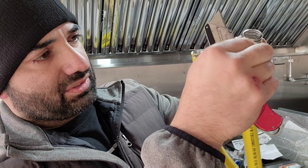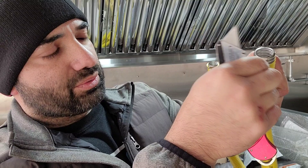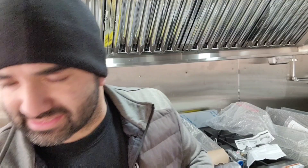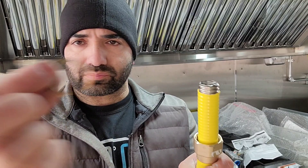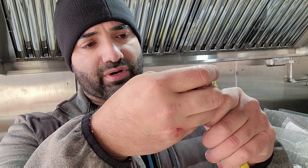There it is — that's how it should end up: two valleys exposed. The next part is super important. The connector set comes with three pieces: an end cap, a little crimp ring washer, and the end fitting. Always slide the end cap on first — that's what will hold the connector in. Then place the crimp ring on the first valley.